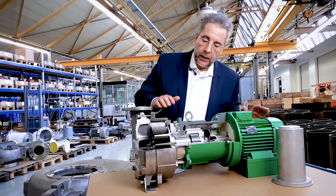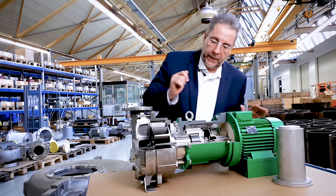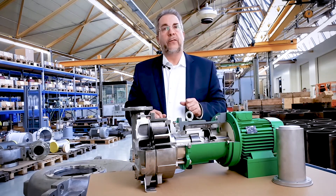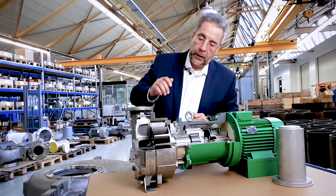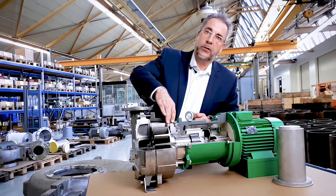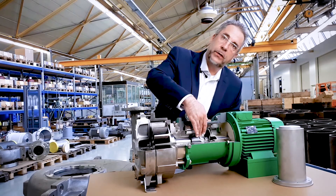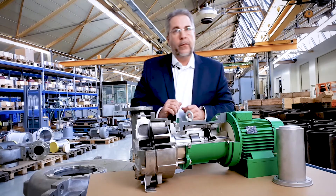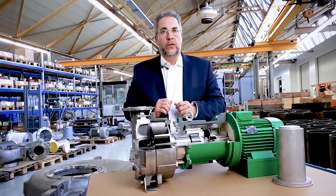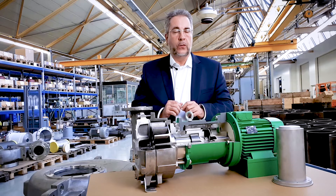The hydraulic part of the pump is equipped with a slide bearing. This slide bearing needs to be flushed and cooled by liquid. The liquid is taken from the hydraulic part of the pump and is led through the shroud to flush and cool the slide bearing. This stream is also used to carry away the eddy current losses and the heat induced thereby.